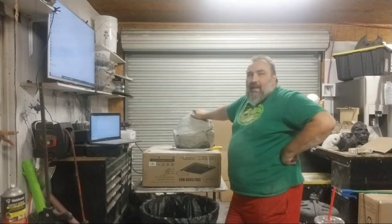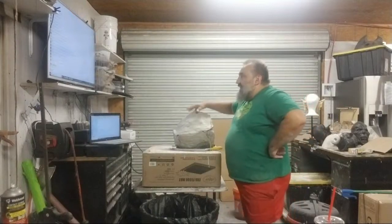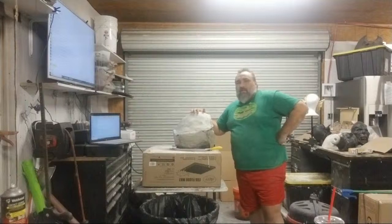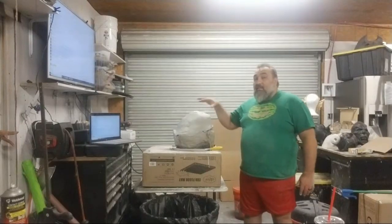Do I charge less for later pulls? No, I don't, because it's a little bit tough to keep track. But if I pull a mask out and it looks bad, I don't sell it. What I can do now is fill this with latex, then foam fill a copy, pull that out, and have a master. I'll Dremel all the seams off of it, and then I can make a mold off of that master, which just comes out, one-piece mold. And then from that master mold, I can make as many molds as I want.